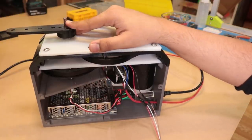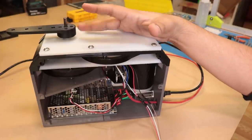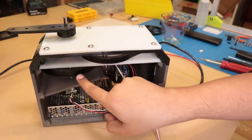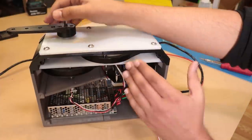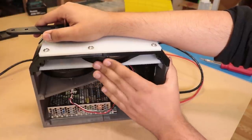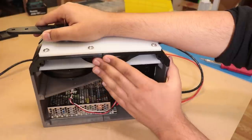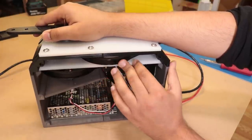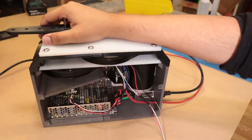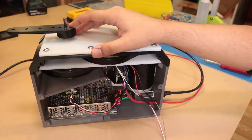Now, these shafts aren't ideal. They're just D shafts, and they're kind of puny. And of course, these parts are 3D printed. So when something's gotta give, something's gotta give, and that's going to be the weakest link in the mechanical system. In this case, that means the PLA of the pulleys, because as you'll observe, if I hold the horn, which is nicely mechanically coupled to the output shaft, I can spin the first pulley and it moves freely. And I can look down and see that the output shaft isn't moving, hooray! Because the D slot inside the pulley has totally sheared and now it is just a hole that transfers no power to the shaft. Oh, going to be back to the drawing board.